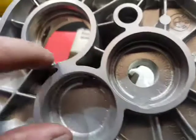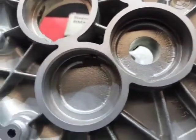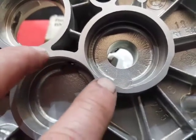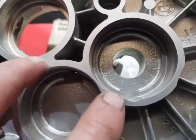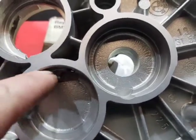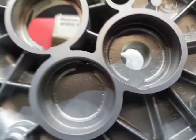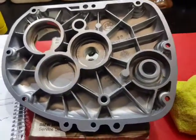This is the input shaft, this is the output shaft. So you set up the same depth gauge — the digital micrometer. You set it up, you zero it on this face here, which is precision measured, and you measure the depth down to those machinings. And you record that on the same table that I'm going to show you in a moment.